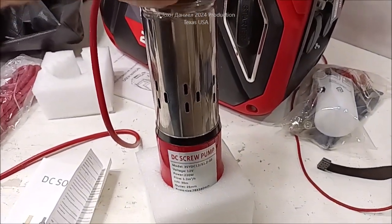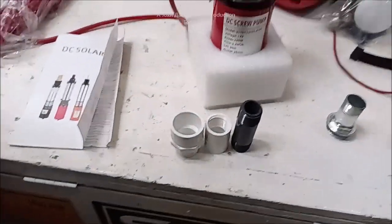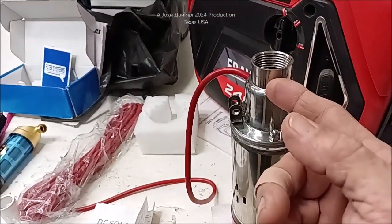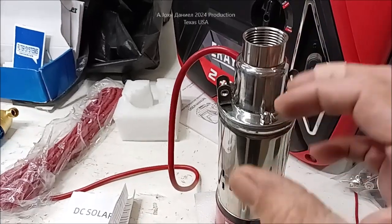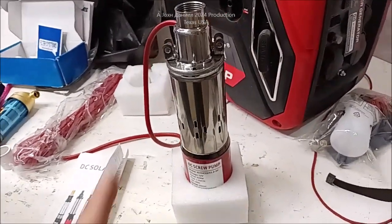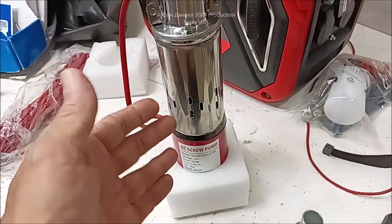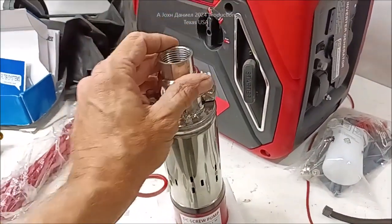These are 111 dollars on Amazon and about 53 dollars on Temu, but they're the same pump — they come with the same completely unreadable set of directions. It's like you put it under a microscope; it's in 74 languages including African clicks. Now, what I do: every one of these pumps has an internal check valve, but the problem is the load of water over 20 feet is more than that little check valve can handle over time. It flaps open, closes, open, closes — it's just a rubber disc with a brass center. When they fail, your pump will cycle, cycle, cycle and die.